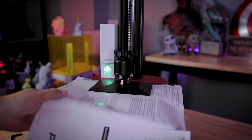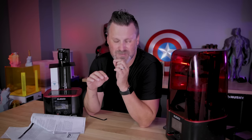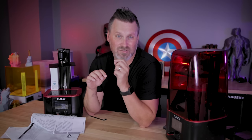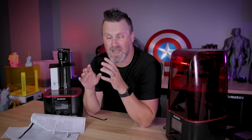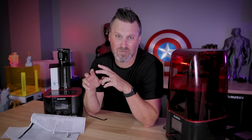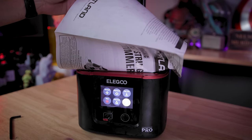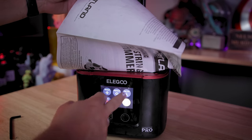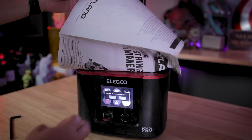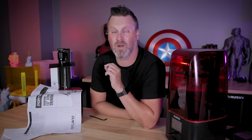When I do my leveling, I like to make sure the paper doesn't move at all. However, some folks like to move the bed up ever so slightly so there's a slight drag on the paper. I've tried both methods and honestly don't think there's much deviation between the two depending on the printer. You can then go into the menu system and change the Set Z value to the positioning your build plate is currently in. The Set Z doesn't impact homing at all — what it impacts is the actual starting position of your 3D print.